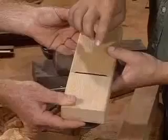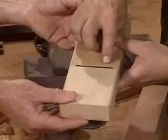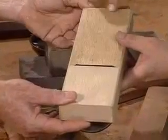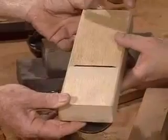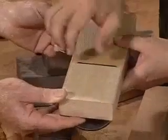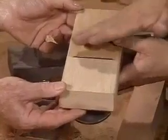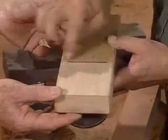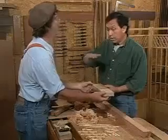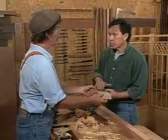Yeah, that's right. The Japanese plane only hits the wood, the surface, right in front of the blade and right at the very front end of the plane. So it's hollow in here, and this is given clearance as well. Most importantly, completely given clearance in back of the blade. That doesn't touch. And now the hollow here just makes it very easy to make it hit in a coplanar manner on two surfaces. So that's just very easy. And there's less friction, too.